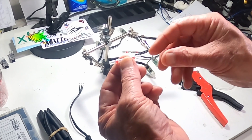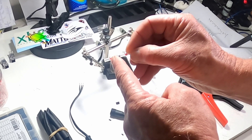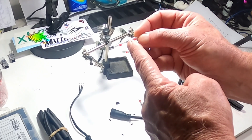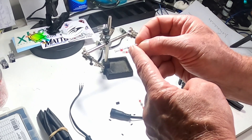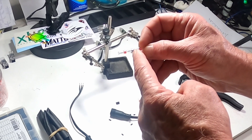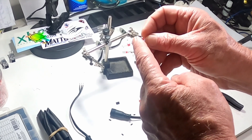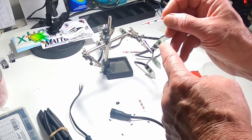I'll put it in and place the solder sleeve so the solder joint is right over the wire. These two bands here are what actually go in tight when it heats up — they shrink really tight onto the wire and provide waterproofing. This middle section here is your solder and when it gets hot enough it'll melt. The first time I did it I just waited until it shrunk down and thought it was good, but it has to shrink down and you'll see the solder flow — sometimes left, sometimes right, sometimes both sides depending on where the heat is. Make sure you get the right size for the wire; for everything we're doing it's pretty much going to be the red ones.